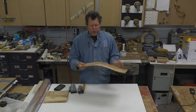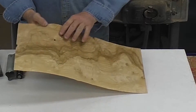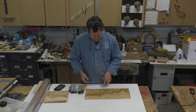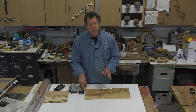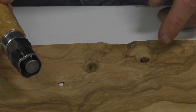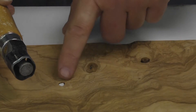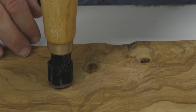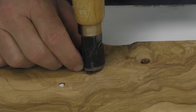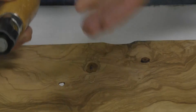When I'm working with veneer, I obviously inspect the veneer, and you might have some open holes or knots that you may not like and want to get rid of — they can be an eyesore. A cloud punch is a very easy and fast way to do that. The first thing you want to do is to see if the cloud punch will fit completely over the defect. In these two cases it's clearly not going to be a problem, but this one here I'm actually not going to make it — there's just a little bit too much.